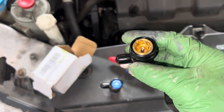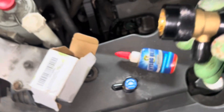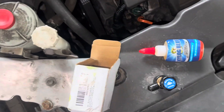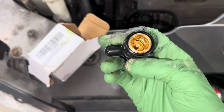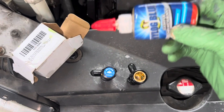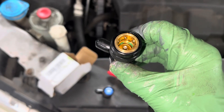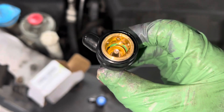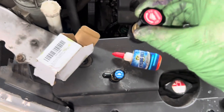You don't see the o-ring, so let me back this off. You see it's closed right now, so I need to use my other hand — I'm holding a phone off-screen — and I'm backing it off, opening up the fitting. Now you see the o-ring there. If it was warmer it would be a little more runny, and what I'm trying to do is get that lubricant over that green o-ring down inside there.